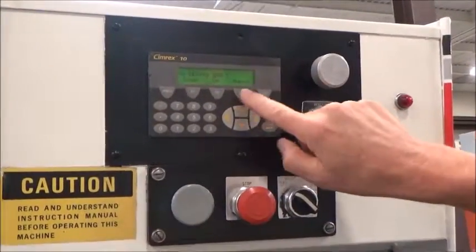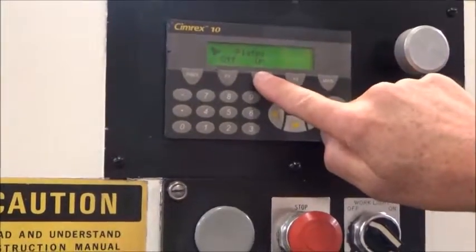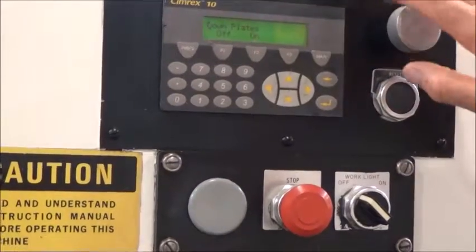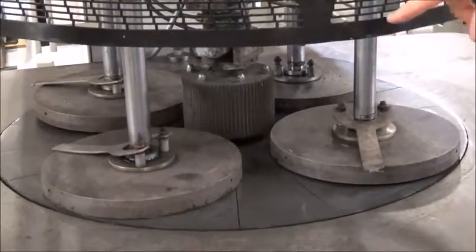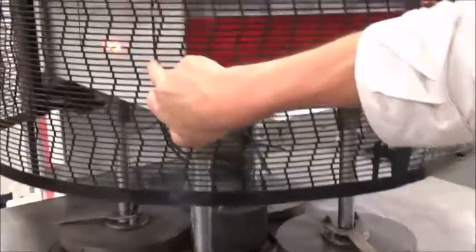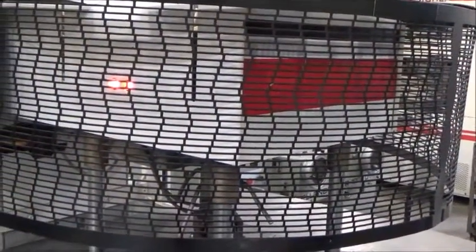Going back to number of plates and slurry — and then the manual has like three or four options. If we've got plates on, we can do that right away. We've got the air up here — it's on. That brings the plates in. We're still in a manual mode, and that's how you set all your lights on the side. As long as all the lights are lit on the side, the machine knows the cylinders are down and gets into automatic mode automatically.